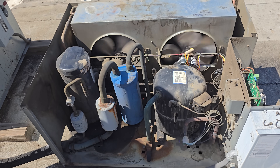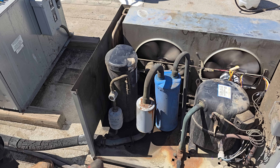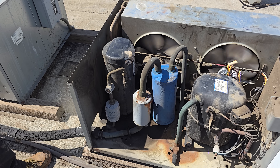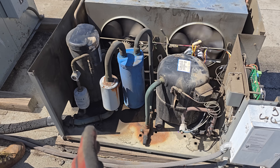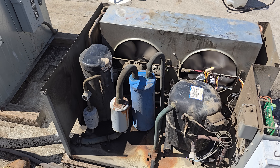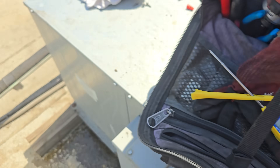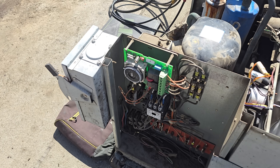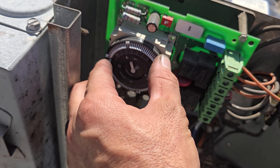Both fans are moving air. We're going to let it run for a minute. The sight glass is going to be flashing right now because the evaporator fan motors aren't running yet. It's going to take a long time for the evaporator to get cold enough for the fan motors to start running. We can go ahead and gauge up on it, but we can't evaluate it until we're 100% confident the evaporator fan motors are running. It's currently about 105°F up here. We'll set the time on the time clock - it's 3:20.